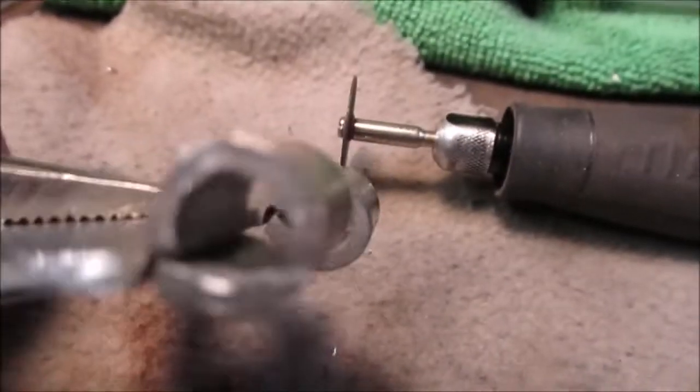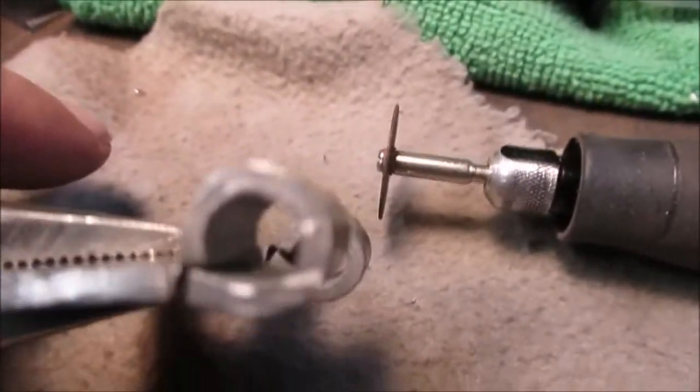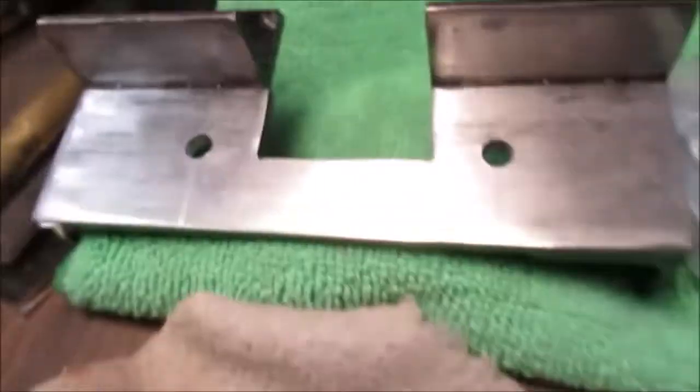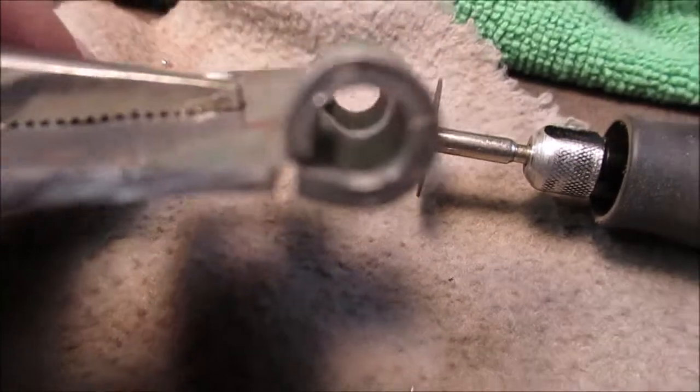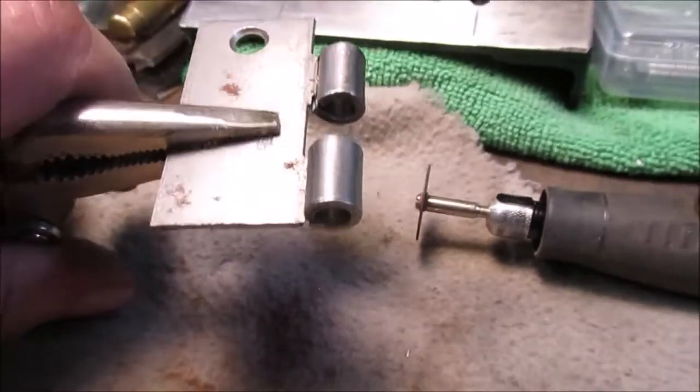Take your pliers and break it off. Even on thick steel — like when I was cutting the other day. Don't cut all the way through when you're using a Dremel blade. Just keep getting close to it.